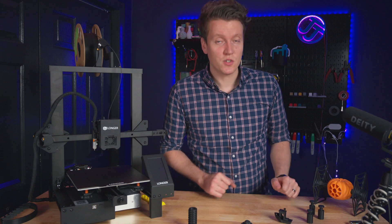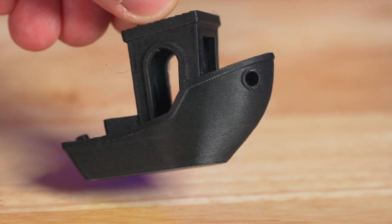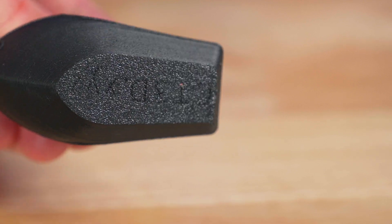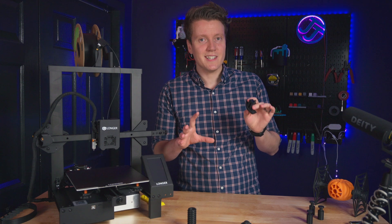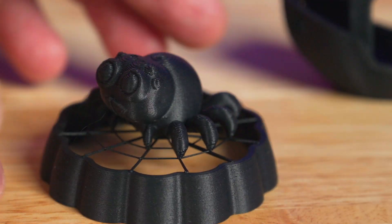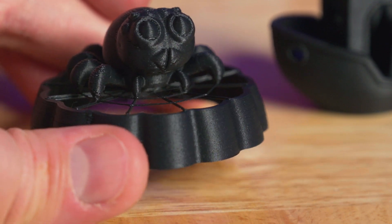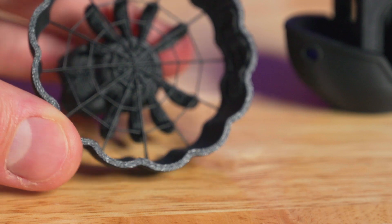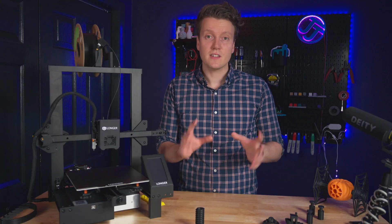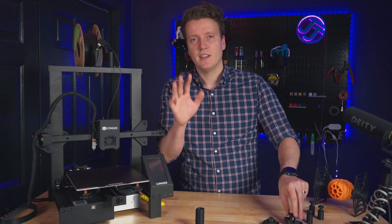Next up, I think we should cover the prints to show you how well it printed. This 3D Benchy might be the greatest 3D Benchy I've ever printed. It's printed in a matte filament so it does hide some defects a little, but it just turned out great — all the overhangs look perfect and all the little details are so good. The bottom always looks good on a textured PEI coated sheet. We also have the E3D torture test, which prints a thin spider web and then an entire spider on top of it — really difficult to do, and this one handled it so well. I was incredibly impressed with the stock Cura profile. I only changed it to print with a skirt instead of a raft — that's a minor change I do on every profile.